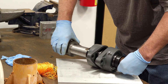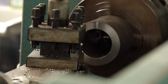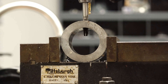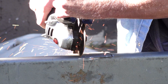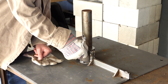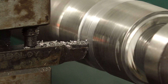To construct the base, I used a 2-inch inside diameter pipe with a half-inch wall. First, I put the pipe on the lathe and machined the ends to have perfectly flat surfaces. Then, to secure the shaft in place, I drilled a 5-16 hole and used a hand tap to cut 3-8-16 threads. For the base plate, I found two scrap stabilizer plates from an old computer cabinet, clamped them together, then cut out an area to attach the pipe. I welded the plates together along with a 3-inch pipe segment. In order to prevent the main shaft from getting stuck in the base plate due to burrs created by tightening a 3-8 bolt, I machined a groove about 1/8th of an inch deep where the bolt contacts the shaft.